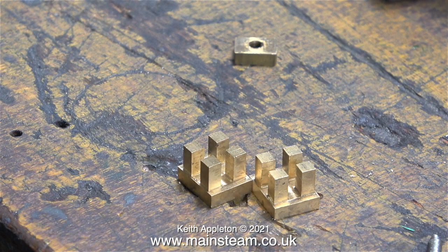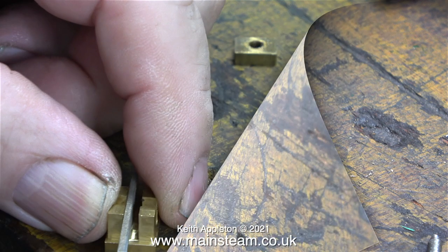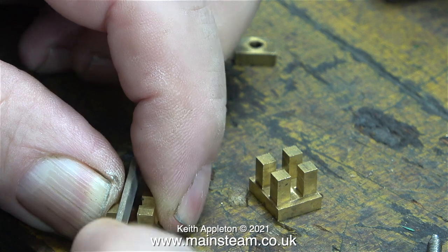What I'm about to do is use a needle file to slightly enlarge the slots in the valves to give a bit more clearance, then I'm going to reduce the thickness of the drive block by rubbing it on some emery cloth followed by rubbing the block on a piece of wet or dry sandpaper. I'll start with the filing.